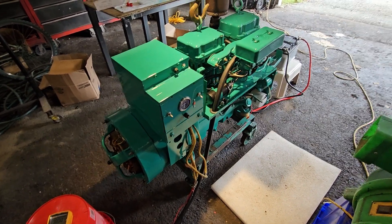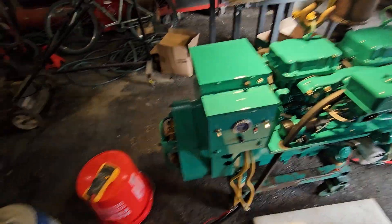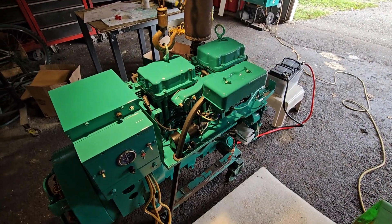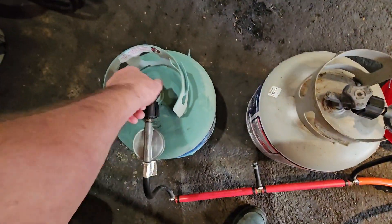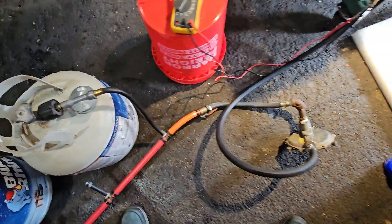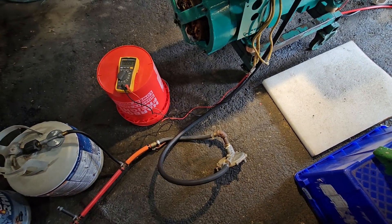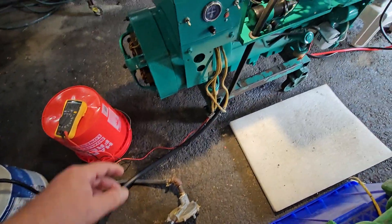It had no issues with the motor. We ran it on propane — obviously not gasoline yet, but it'll run gasoline, probably just need some adjustments. Alright, let's crank her up. We got everything open — valves are open. We don't have a solenoid in line right now; I don't care about it at this point, but in a permanent installation you would want a solenoid for safety reasons.